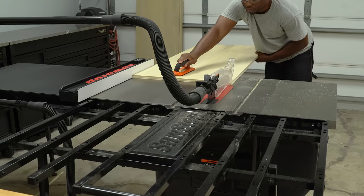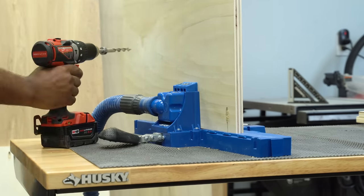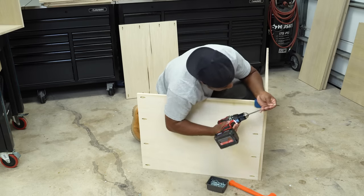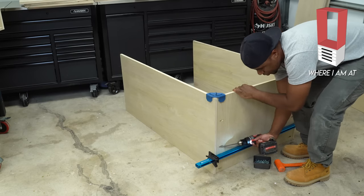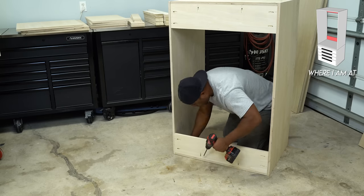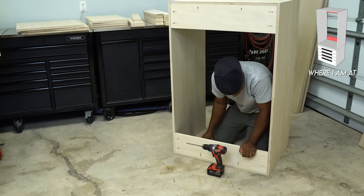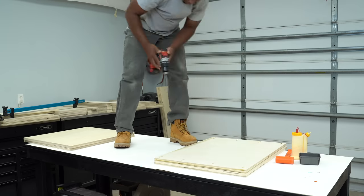Now that I have all the parts cut, I'm going to start building the frame for the upper cabinet. I drill pocket holes in the plywood for the bottom and the top panel. Before putting the two together, I apply wood glue to the joint. Now as this is coming together, I can put the last panel on to close up the frame. Before I set this off to the side, I'll add the back panels. This is going to allow me to attach the cabinets to the wall. At times I prefer to work on the floor, but sometimes I like to work on top of the workbench. Now I can get started with building the lower cabinet.